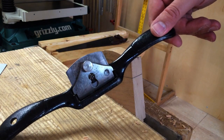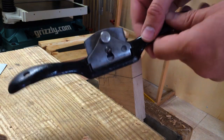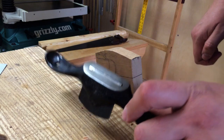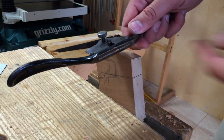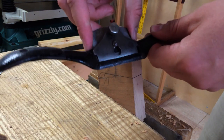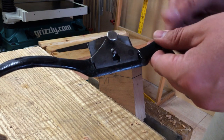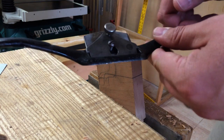To me that's just getting in the way and all it's doing is making things much more complicated. When I want to deepen a cut on a spokeshave I'll just flip it over and whack it on the bench top and that will incrementally increase that. The other thing is the screw adjusters can really allow you to drop that blade parallel to the sole just by maybe two turns here, two turns there, and allow you much more control over it.